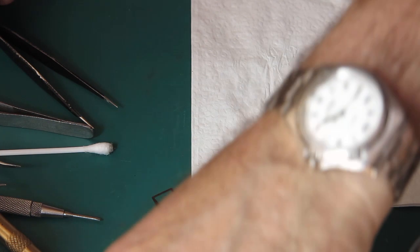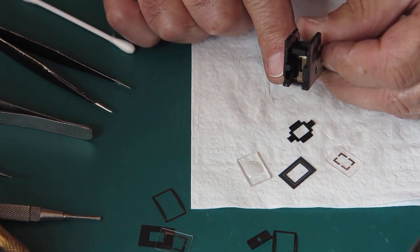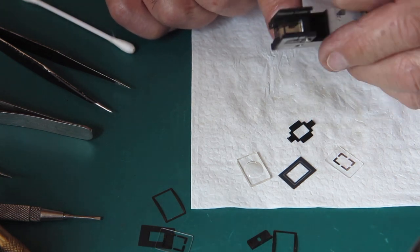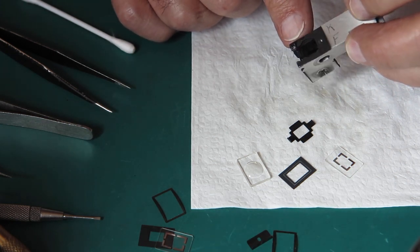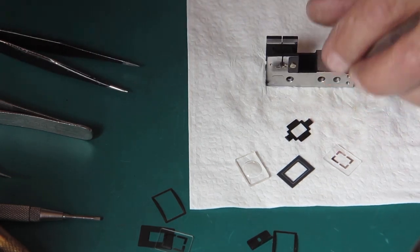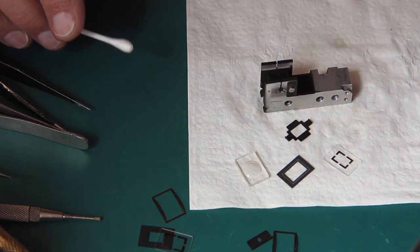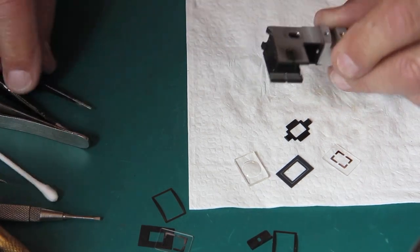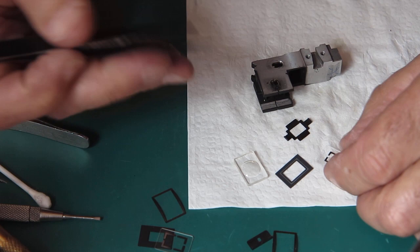That's nice and clean and ready to go back. I've got to be reasonably cautious with the painted part — if you overdo it wiping with acetone you'll wipe the paint off, so all I want to do is just get rid of any lacquer. In the rangefinder body, all that's left in here now is the semi-silvered mirror. The surface facing to the front of the camera is glass; the surface facing to the rear — to the eyepiece — that's the semi-silvering. Don't touch that surface.